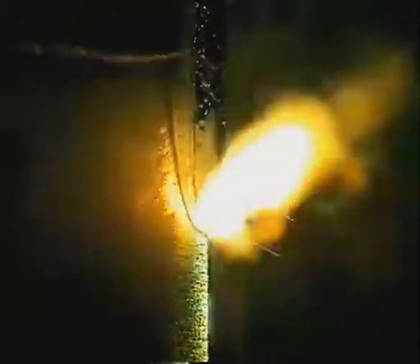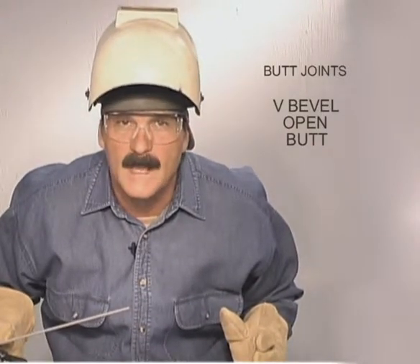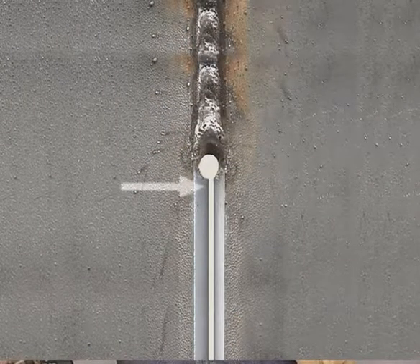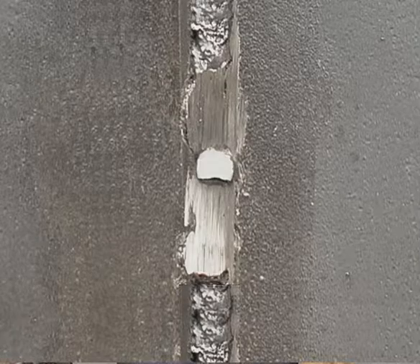If you're not getting all the way through, you will see filler metal squirting out behind the rod, back up in the bevel. Most of the light and sparks will be on the back side, and you're building weld on the back of the metal. You want the amperage relatively high, so try starting about the same place as you'd run flat. If you do open a hole, stop right away, pulling the rod back over the bead. Restart right at the edge and keep going. When you've finished the weld, grind the edges thin on both sides of the hole and fill it in.